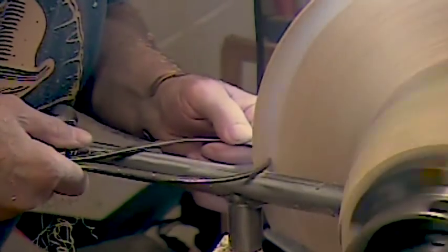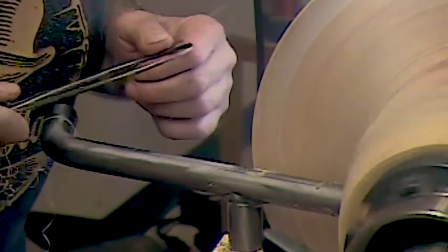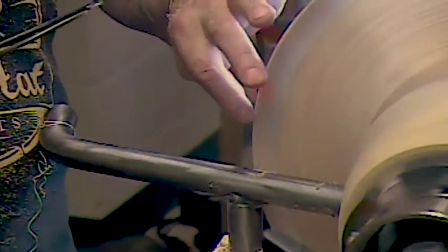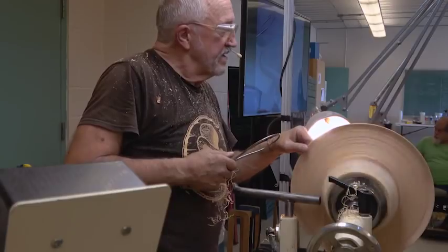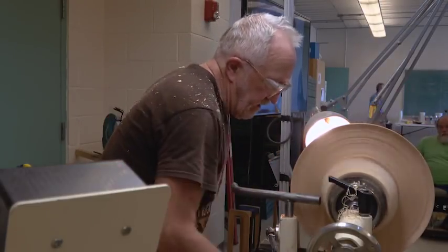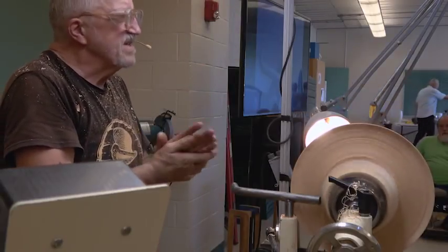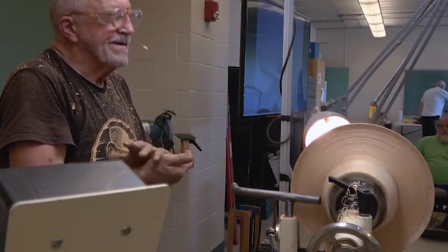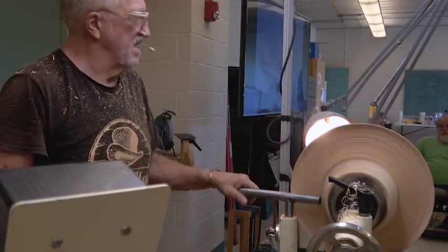So now, behind there, I'm about a 32nd thinner than I am right at the edge, which was the desired result. Right at the edge, I'll leave a little thickness. I used to do hats at 3/32 at the edge, the whole thing. For years, that was the thickness I did. And then someone said, can they be thinner and lighter? Well, I do mini hats less than a 16th. Yeah, I could do a big hat less than a 16th.